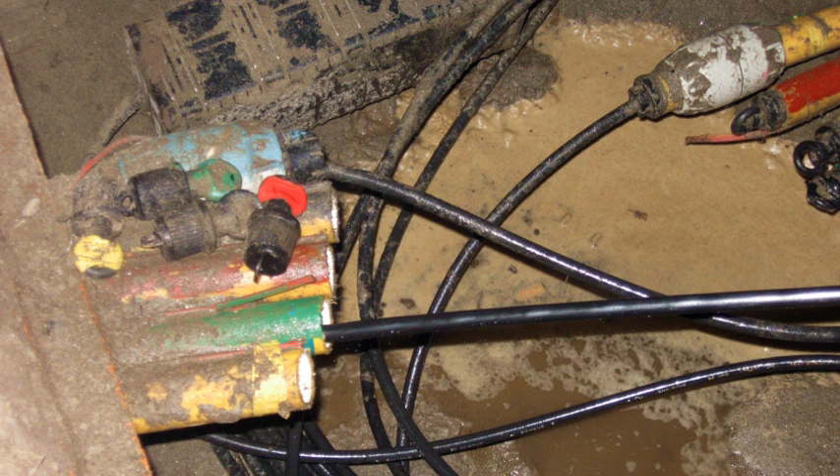In the 21st century, the cable jetting technique is used worldwide, from small optical telecom cables 1.8 mm in diameter in small micro ducts 3 mm internal diameter, up to large copper telecom cables 35 mm in diameter in large ducts 50 mm internal diameter. Jetting is done with compressed air pressure in the order of 10 bars. With the jetting technique, distances per blow of 3.5 km have been reached, while spliceless links of 12 km have been reached by placing jetting equipment in tandem. It is possible to install 12 km in one day with one small crew.